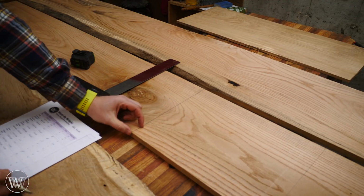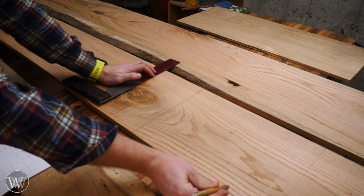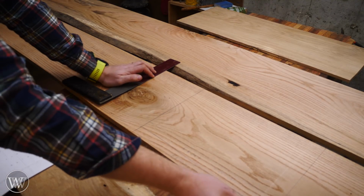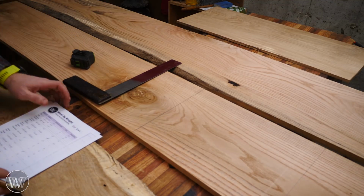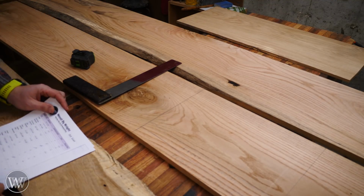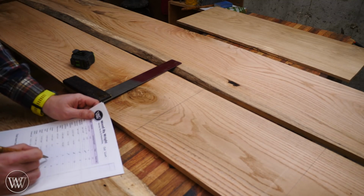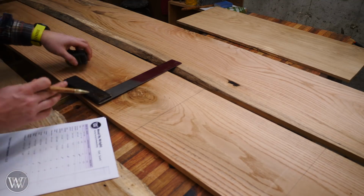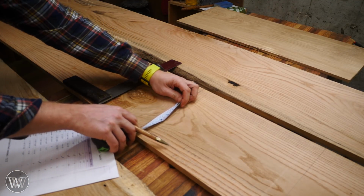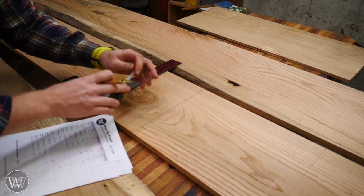So there's a stretcher that needs to be 3/4 inch. So I'm going to make a rough line somewhere around an inch, 1.25 inches, maybe 1.5 inches. And then another one up a little bit farther. I'm making these rough and I'm making them bigger than they need to be. And then I can label what they need to be. So then I can mark off, I've done that one, I've done that one. And the next one is a 3.5 inch board. So I can come up 3.5 inches. Actually, I'm going to come up 4 inches from there. Put a mark right about there.